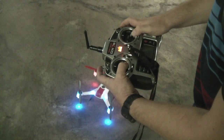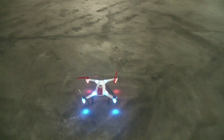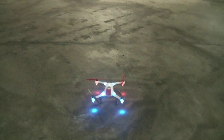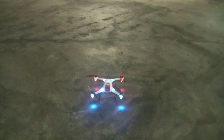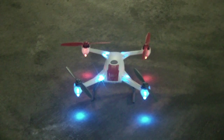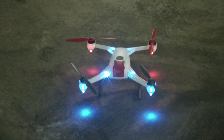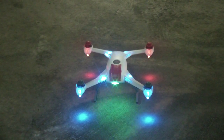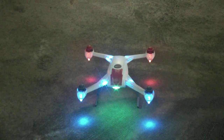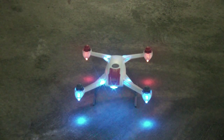Okay, so it's now bound. We can release the elevator. What I'm going to do is put the quad into stability mode, because we need to flick it into agility mode when we're flying. What you're going to see when I arm the motors is that light is going to change. I'm just arming the motors — you can see it's now flashing green, red, and blue.